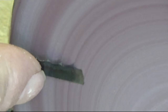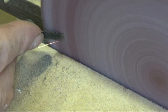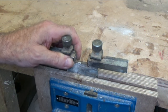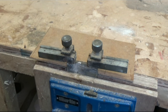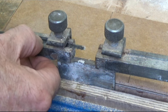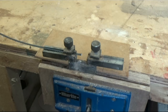This is to get both ends to match perfectly, so it might take a couple of tries to get the tapers to match. I guess an extra jig could be mounted onto the sander table to get the exact angle of the taper. I then mount the jig in the vise using a scrap piece behind to prevent the blowtorch scorching the bench, and carefully insert the blade ensuring the back edges run true on the jig and the feathered edges marry up. Take time to get this right.